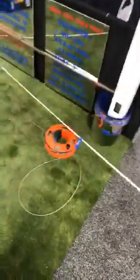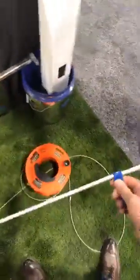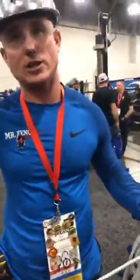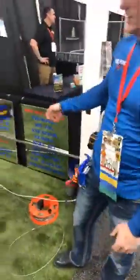Yep. With this tool, I look at where the first post starts, I go to the 9th tack, and I pull that to the other end. And as I do that, every one of those is equally spaced over the whole job. You're kidding me. So there's no thinking, there's no math, there's no tape measure. So these are set. Set. And when you pull the 9th tag to that 67, or it was 68 feet or 69 feet, these all instantly adjust. How about that? That's pretty cool. So that's called the equalizer.